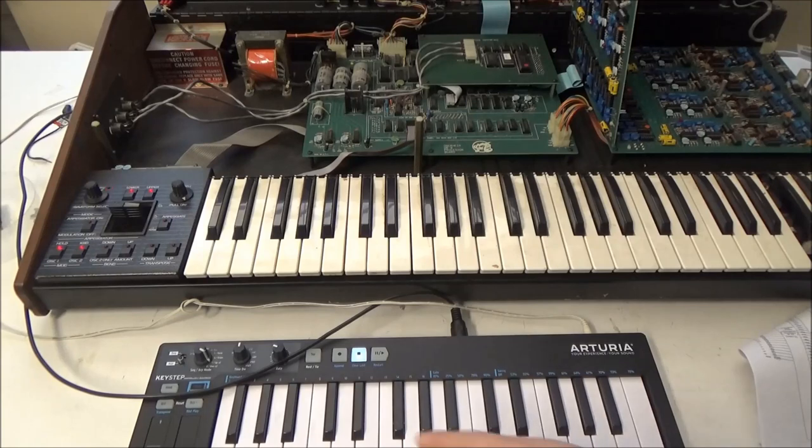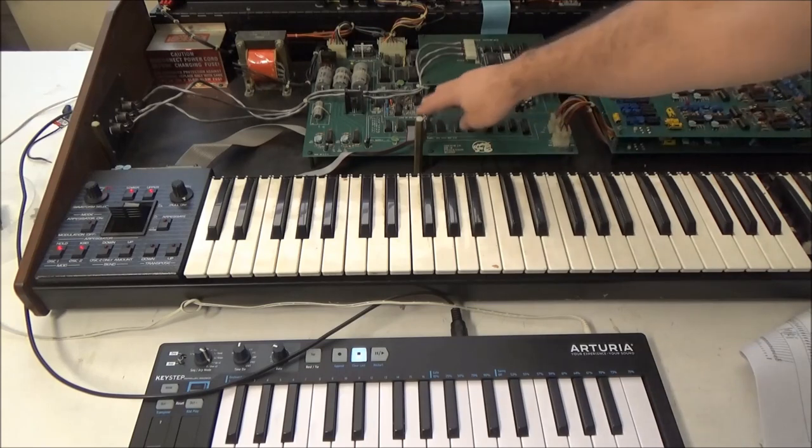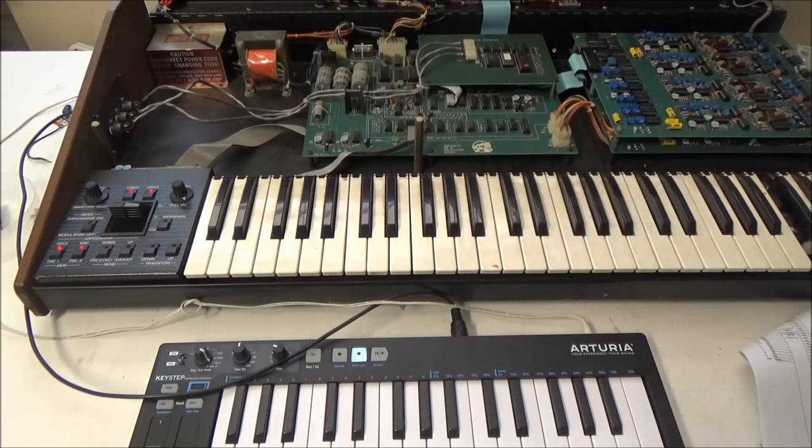Okay, so I've got a small MIDI controller hooked up here. Oh! It works. It's skipping four notes because this voice board's not plugged in. Let me lower this down and then run auto-tune, and we'll see what it sounds like. So through the MIDI controller, it's working. The voices sound very inconsistent from voice to voice, and this voice 8 here failed auto-tune and was removed, but we're actually getting audio output. So it looks like the problem is with the keybed scanning, not a problem with the audio output.